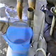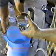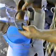If you have the mesh like this, heavier actually is better. Where's that other one, Peter? Down here. This is the actual size. It's a very large mesh. This is cut off the mesh what we had in the units. It's an 8 mil square, and the meterage to the next hole is 12. So it's known as 8 mil square with 12 mil centres. Testing this will show that off these bits here, you will get probably four times the amount of gas as what you can get off this stainless, which is sealed.